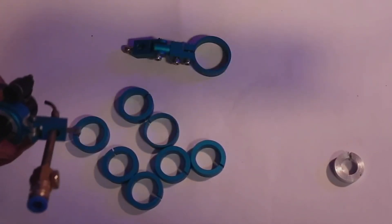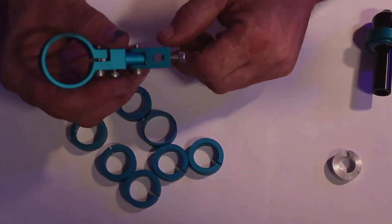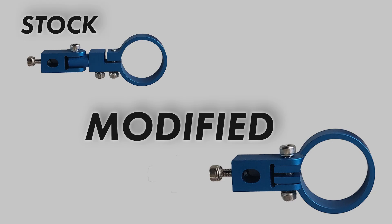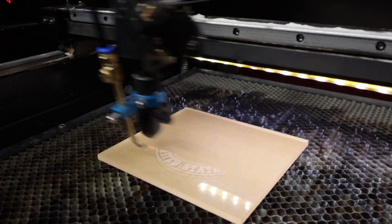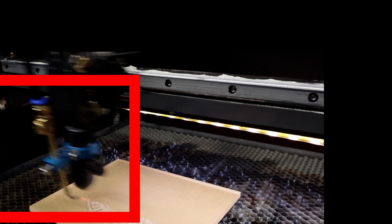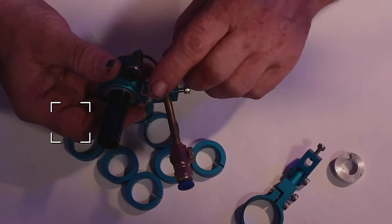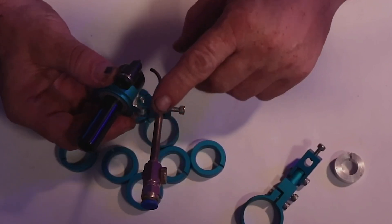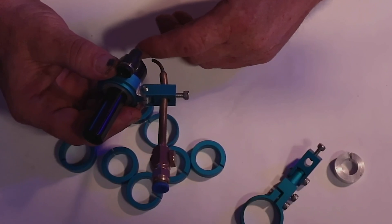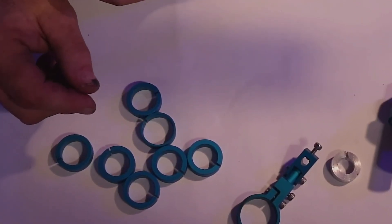If you notice the difference between mine — the distance from the center of the tube to the back of the screw — it's a lot shorter. When you look at the bracket that comes from Amazon it's a lot longer. So I modified mine, which does two things. Number one, it makes it shorter so when you're in the machine and running a bigger job, this nozzle will not bang into the front of your laser. The other big thing is the angle — the shorter the bracket, the better the angle for the tube and air nozzle to hit 90 degrees and go straight back. It just makes life a lot easier. So with that said, let's put this together and run a sign.